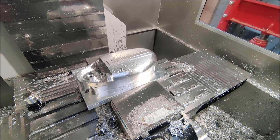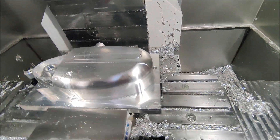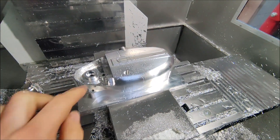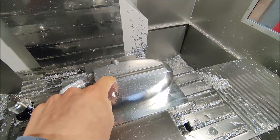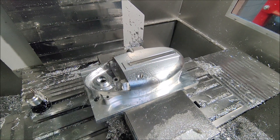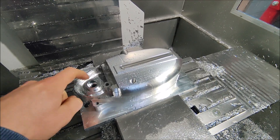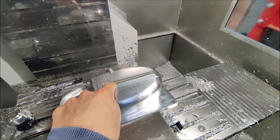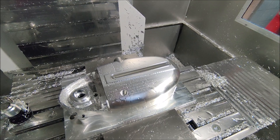The 3D operation is now finally finished, turned out quite nice and smooth. Now the next step is to mill out the letters where the logo will be, and then do some drilling and thread cutting for the oil plug. This will be another slow process because I have to do it with a 2mm end mill so it won't go that fast.